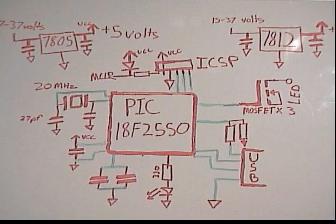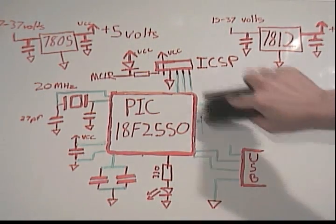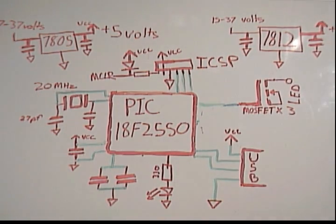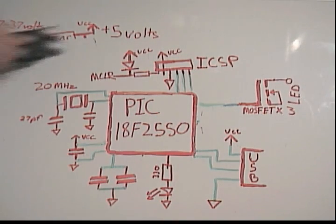This is the circuit from the USB color changer project. In the middle, there's a PIC microcontroller with USB support. We'll use the same design this time. The gauges will always be connected to a PC, so the PIC is configured for USB power. We don't need to use a pin to sense the USB connection, so we can get rid of these resistors. We also need to connect the USB power pin to the power for the circuit, and we don't need the 5 and 12 volt power supplies anymore.